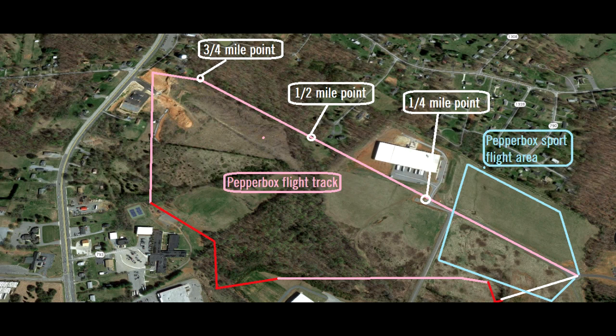It actually exceeded the three-quarter mile point with perfectly usable video. The area in blue is where I did the low altitude sport flying, attempting to simulate a mini quad race — this is the approximate size of most mini quad tracks, and the video held fairly well. So it's apparent that you can still race a mini quad on an FCC Part 15 transmitter, but flying behind objects with that low power becomes a problem. I learned a lot from this test and I hope you did too. Stay tuned for even more testing, and thanks for watching.